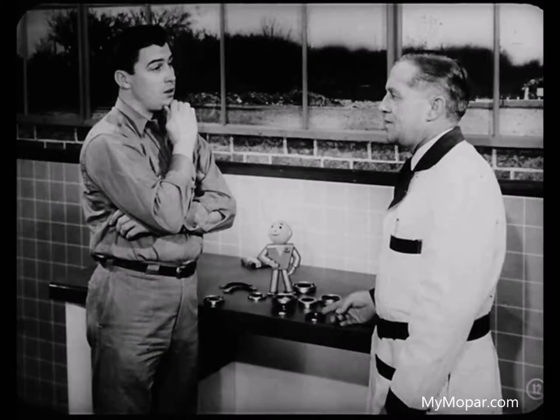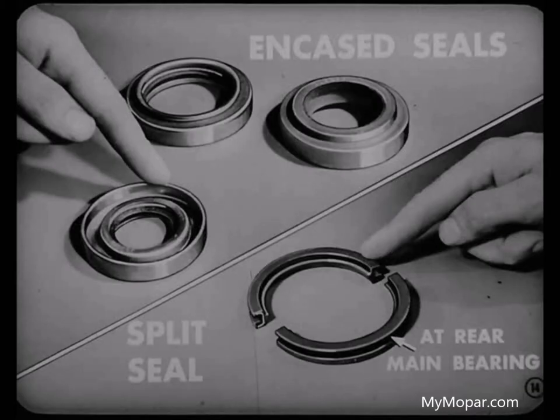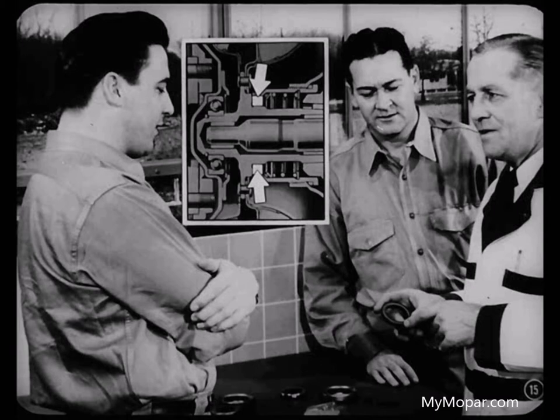Some of those look alike. How can you tell them apart? Well, Roy, there are actually two main types that we're concerned with: the rotating shaft seals, like the rear axle shaft seals you and Ben replaced, and static seals. A static seal is that gasket between the cylinder head and the block. Hole plugs or any paper, cork, rubber, fiber, or other type gasket are also examples of static seals.